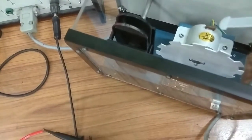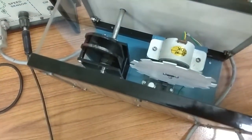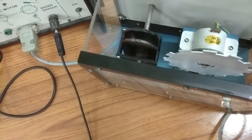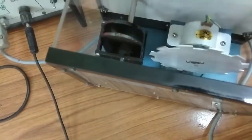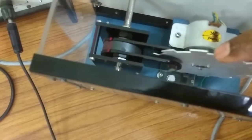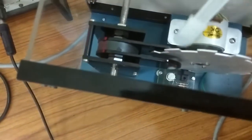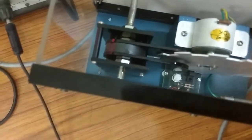It is a permanent magnet, so the field is constant and we are controlling the armature. The aluminum disc has another purpose: loading. You can see the permanent magnet here. When this permanent magnet is placed across the disc and the disc rotates through it, eddy current is generated in the disc, and as a result it acts as eddy current braking.